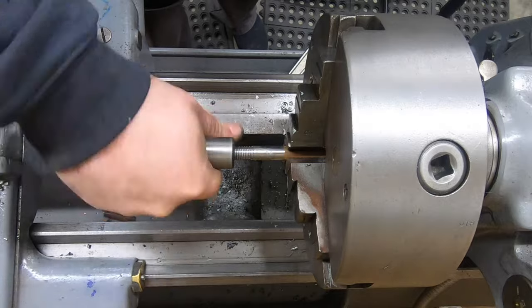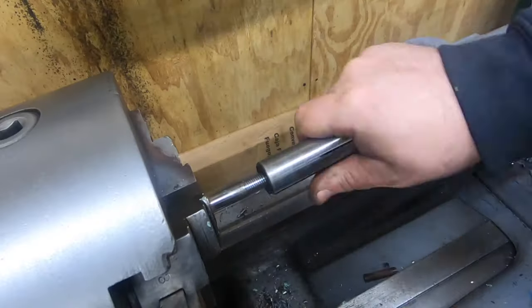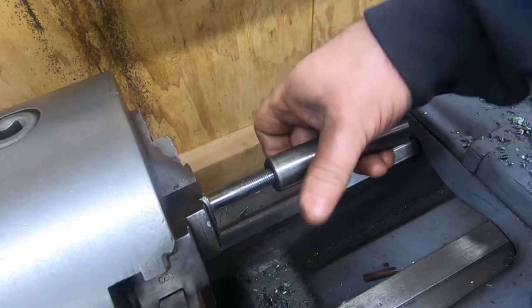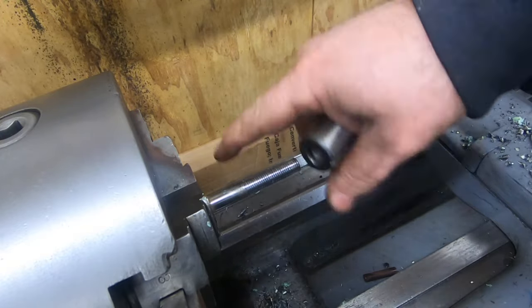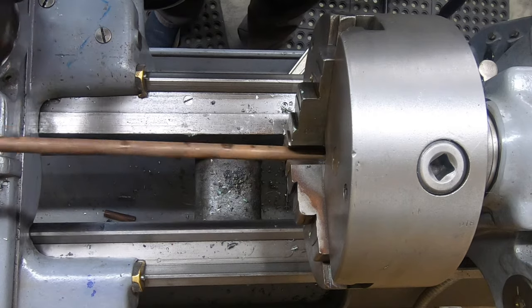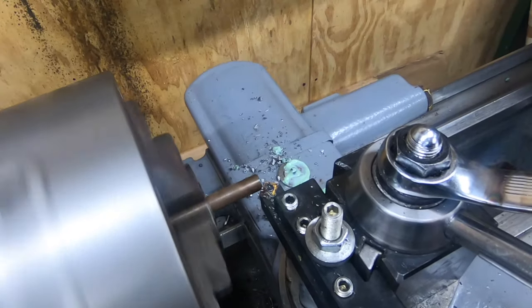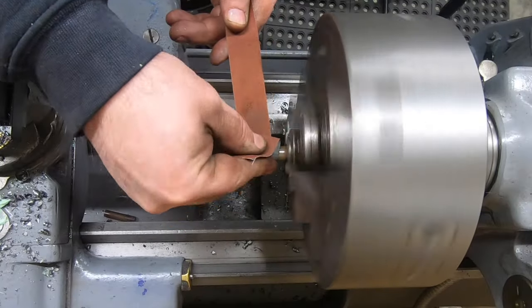The thread at the beginning is a lot looser than it should be, but quite frankly I don't think it's going to matter - this should thread into that input spindle a lot deeper than that. I'll go ahead and flip this around, clean off the other end, and chamfer it to get ready to be pinned to the one-inch stock we started in the last step.